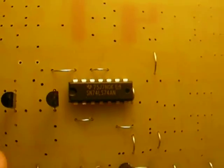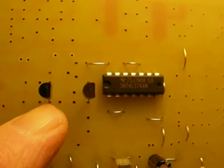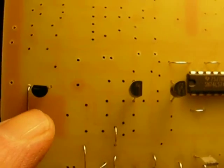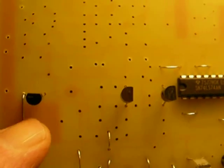Look at the face of the transistor and make sure they face this way — don't turn them around backwards. Make sure they say 2N3904. The next part to mount is the 78L05, which is a little three-legged voltage regulator that looks just like a transistor.